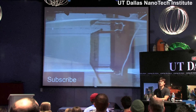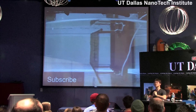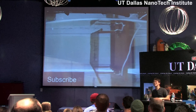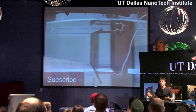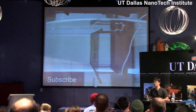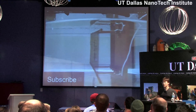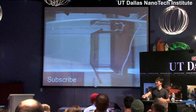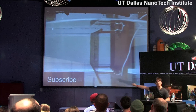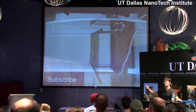They're electrically conductive so you can use electricity to drive them. And one other thing that makes them important is that you can heat and cool them very quickly. As you saw, they're very low density — they float in air. When you heat it, the heat almost instantaneously heats up the air around it. This effect is called the thermo-acoustic effect — it's been around for a hundred years. Alexander Graham Bell started it, but he was limited to thin foils that don't transfer energy to air quickly. With our nanotubes, we can do it a hundred thousand times a second — the maximum frequency our ears can hear is twenty thousand — so we can produce any sound your ears can hear.